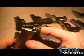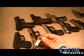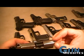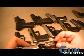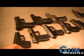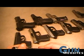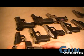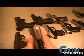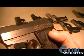So now I've got guide rods coming down both sides, and again I'm going to lift that barrel up to where it looks like it should be. Move this, come on down, and I'm not under tension, that's the problem. So what do I need to do here? I need to come back until it hits that notch, which is under spring tension. Now I'm going to bring this lug down and allow it to rotate into position. So the lug on the barrel actually holds the whole thing together. Genius. Real interesting little design.